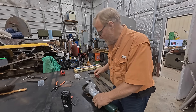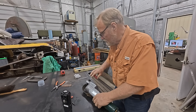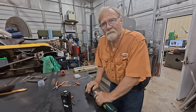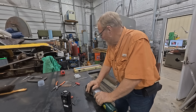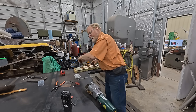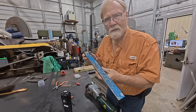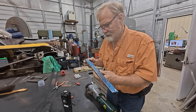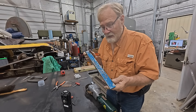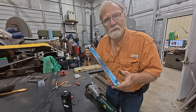This is a Biax scraper, and what I'm doing today is working on the Bridgeport gibs, getting them back in shape. Now this one is the one for the knee, and that blue stuff is the ink I'm going to show you — on top of my granite surface plate. What I've been doing is scraping this with this machine to get it perfectly flat.